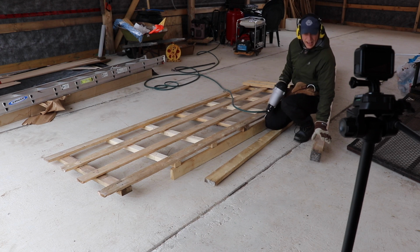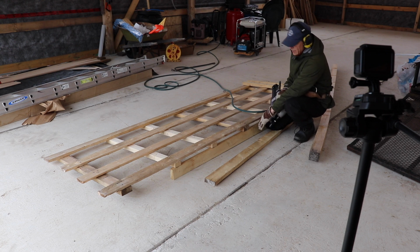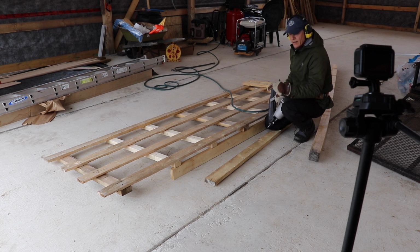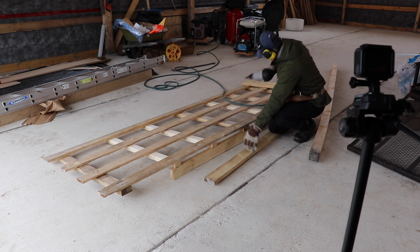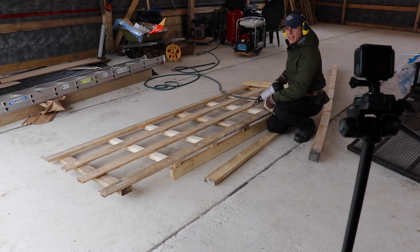So I'm going to make the legs out of this, it's either spruce or pine 4x4. I've got support rails that run 3/4 the length of the table. I'm going to have overhangs on each end, which I'm going to put 45-degree angle supports into, just because I'm only going to buy 4 casters, and I'm going to put the casters underneath the posts that'll be there and here.